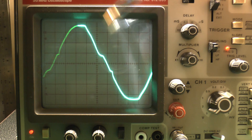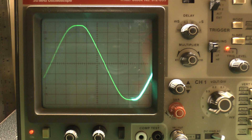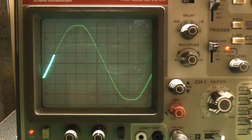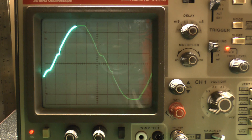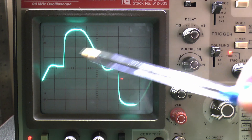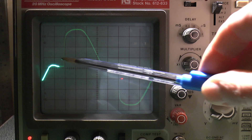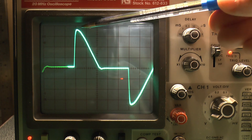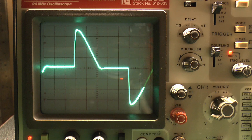Switching back to the proper sine wave, the brightness does increase slightly, since even at full it's still fractionally under maximum. The LED dims quite smoothly — not a particular problem there. Now I've changed the dimmer settings to Mode 2 in the instructions, and the waveform is significantly different. We're actually similar to what we had on the old-style dimmer, where it's cutting on the leading edge — the start of the waveform. So it's an off period, then a sharp on point, and it just tapers away, the same in the other direction. Very similar to the old-style dimmer we had previously.